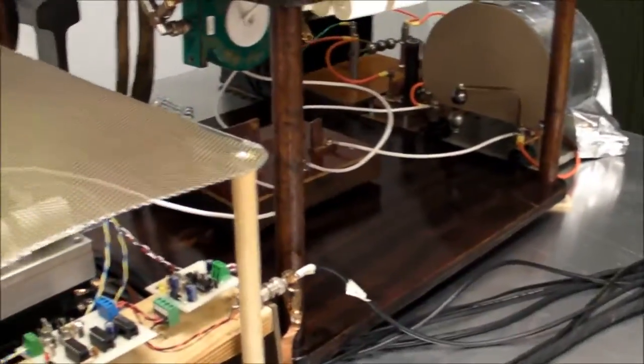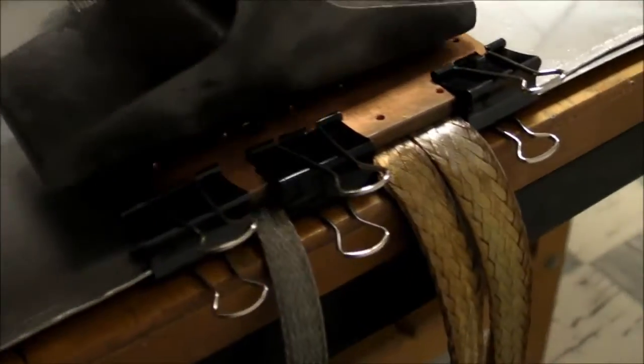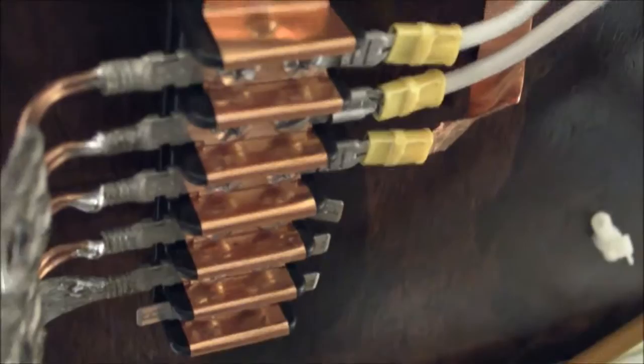I was getting spikes in excess of 30 kV with respect to ground, and that was not good. So what I did was I put a big aluminum plate — several pieces of sheet metal — all around underneath everything, and that basically serves as ground. I've got ground connections: one goes to the floor and the other to the ceiling tiles, all clamped together with a copper bar, weighted down with a section of railroad track, and then a very clean copper strip ground terminal up here where all the grounds go.